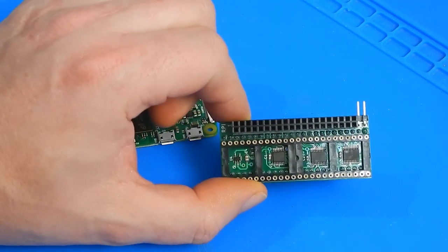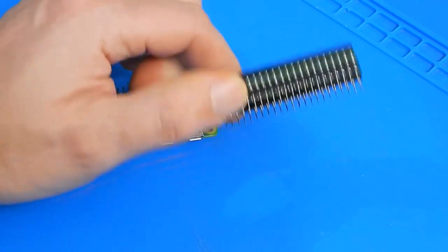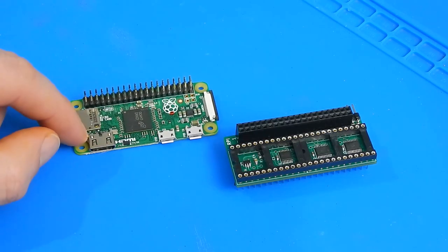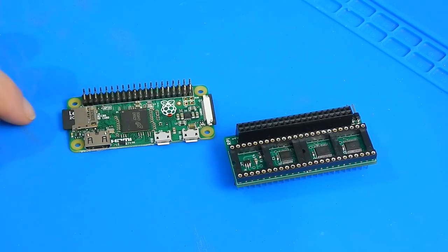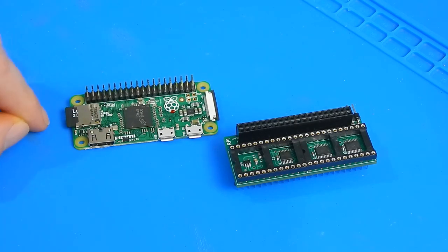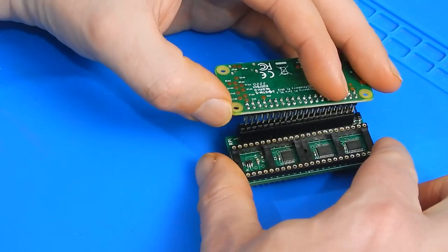Okay, so that's our RGB to HDMI board built. I think it turned out not too bad in the end. We've got the Pi Zero with its male GPIO header installed as well. I've stuck a 2GB SD card in here, which is absolutely loads. The smallest SD card you can find would be plenty. And that has the software on it that you can download from the GitHub. Link in the description. So that goes on there